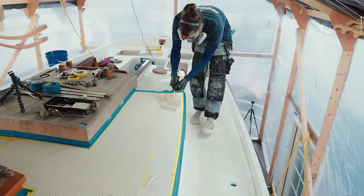The one thing with Barrier Coat that Aladino explained to me is that once you start, you do want to keep going, because, I guess like with most paints, if you try to apply it after too much curing time has passed on the previous coat, then it won't adhere properly, so you would need to sand it again. So to avoid sanding, you really want to do a coat every day.